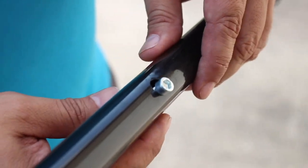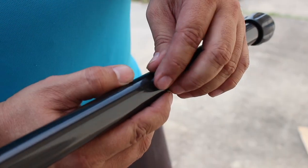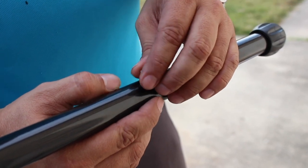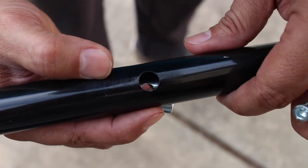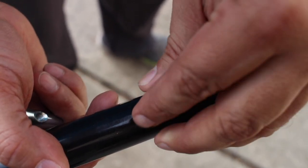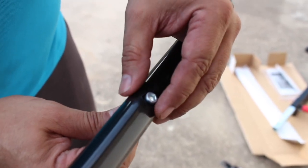I'm going to show you one little tip I found out the hard way. When you're taking this apart, there's a little piece of a rod on the inside. If you're not careful and you just unscrew this screw and move everything around, that's going to get out of alignment, and then you'll spend a little bit of time trying to get it back in place. So just take that off easy. Make sure that doesn't start sliding around everywhere, because it's just loose. Be careful that you don't get that pin out of place, because you'll spend a few minutes trying to get it back in line.